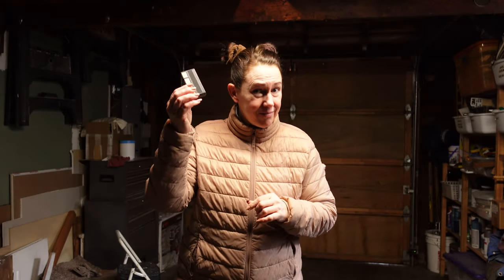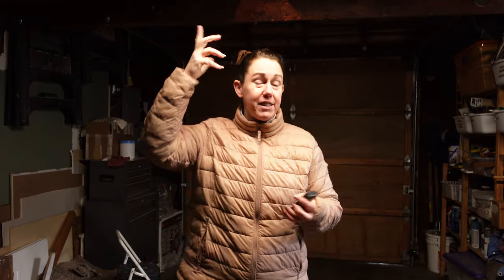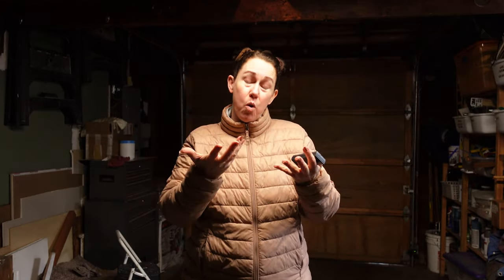Hi, I'm JC — welcome or welcome back to my channel. I'm glad you're here. This is my garage. Today we're going to be fixing my garage door opener. A couple days ago I went to open my garage door and the door is not opening but we're hearing the motor running, so the problem is very likely that one of the gear parts in there is worn out and needs to be replaced.